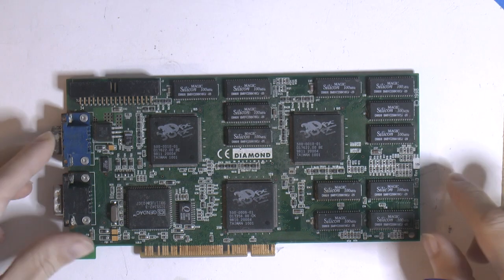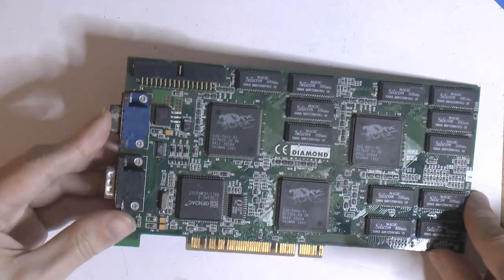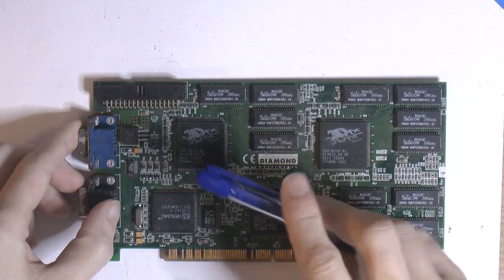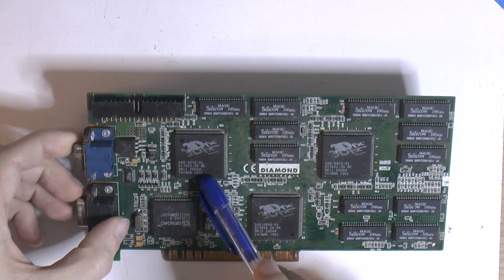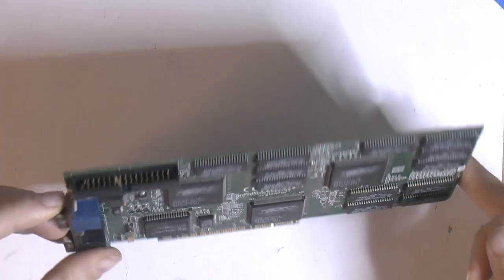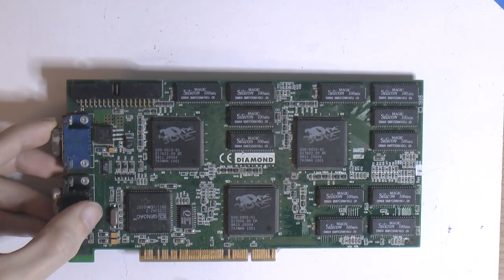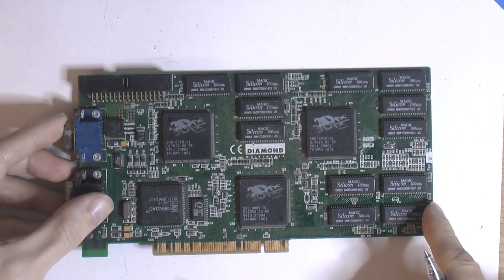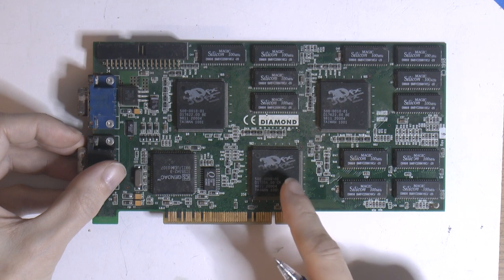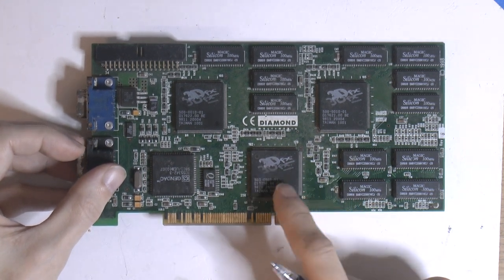And then we've got the last card here, which is quite dirty too, also a lot of corrosion. This TMU here, other than being dirty, seems to have all the pins intact, so that's a good one. This TMU is falling off. This FBI chip has some bent pins, but it might be able to be straightened out. I'm not sure it has any broken pins, like broken off, so maybe a good donor.